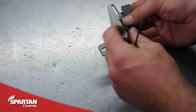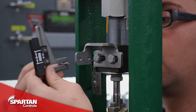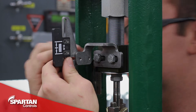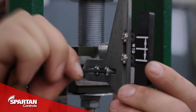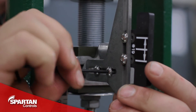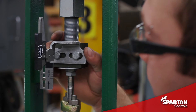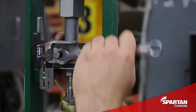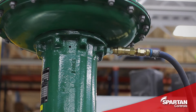Always consult your manual for proper orientation of the extension arm. We can now loosely screw on our extension arm onto our arm connector. With our feedback array loosely assembled, we can now center our bracket and tighten up our connecting block bolts. With the connecting block bolts now tightened, we can remove our actuator air pressure and allow it to return to its failed position.